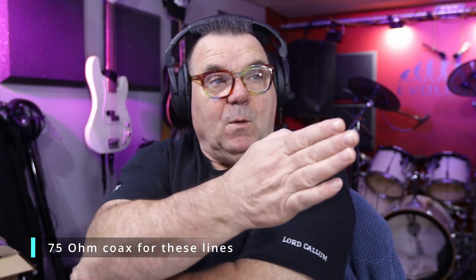I've recently been running this as a parasitic array. Parasitic is much easier — a hell of a lot easier. The only reason you'd want a phased array like this is if you want to switch direction. As it just so happens, that direction is my important way — Newfoundland, New York, Florida, and into the central US. Behind me is just south of Egypt and the Indian Ocean, but I can do that on a straight vertical anyway, so I'm not really interested in doing a switchable two-element. You can also use the two-element in broadside mode, and you get about two to three dB — it basically takes your donut pattern and squeezes it into an egg shape.